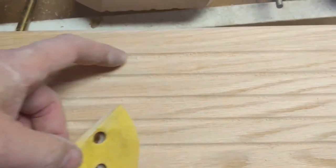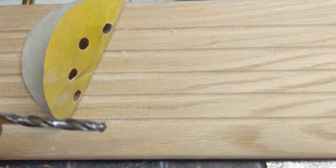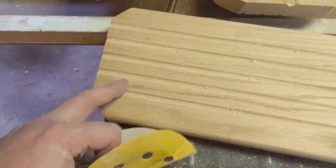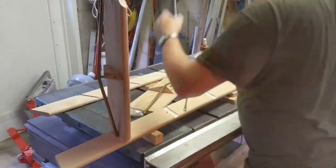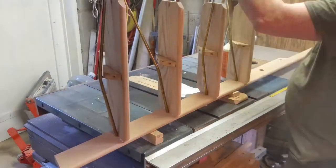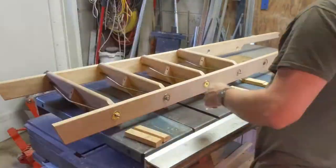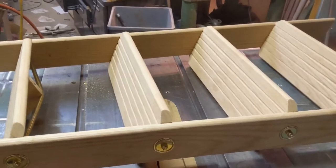These grooves, because they were done with a router, are fairly choppy — see those chatter lines down in the groove. In order to sand them smooth, I just have a piece of sandpaper wrapped around a drill bit. By experiment I found the right size — I think a 13/64ths — that fits the concave real nicely, and then just sand all these grooves. It's particularly important to sand these edges because once it's glued together, you're not going to be able to sand those edges very well. The glue has set overnight and is done.